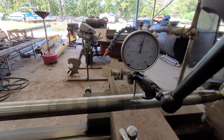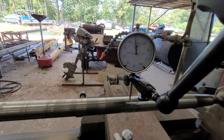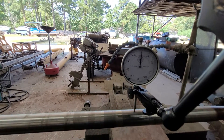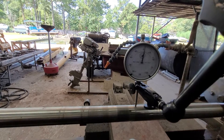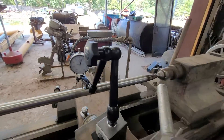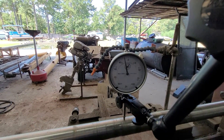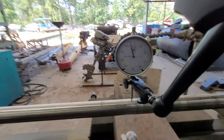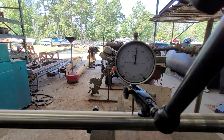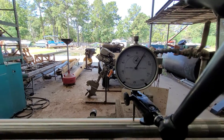We'll go here — this is where the old seal was riding, directly on the portion where the seal was riding. Going further back you can see it changes a little bit. We've got about three to five thousandths. Let's keep walking down. Now we're starting to see a little more movement — getting six, seven, eight thousandths. Now we're at five, ten, twelve, roughly twelve to thirteen thousandths movement.